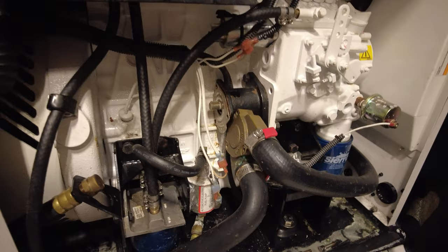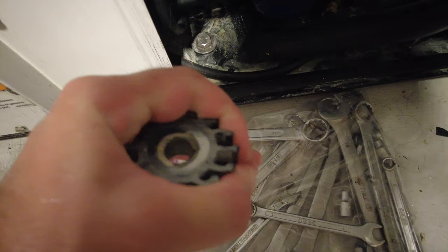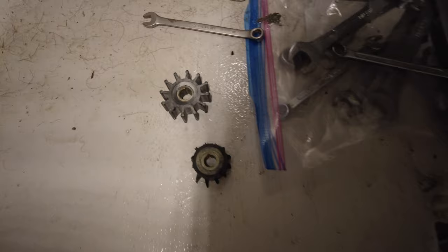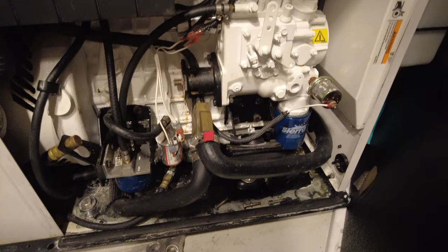Now, the other thing is, you've got to get these fins the right way around, and it's kind of difficult for me to show you inside this housing. But you can see inside this housing, I'm going to have to get them, they bend basically. They bend like this inside the housing. You've got to make sure that you've got them the right way around, because otherwise, if you don't, you break an impeller, you're going to start all over again. So yeah, soul destroying work. As you can expect, this is one of my least favorite jobs on board, apart from broken heads or blocked heads.